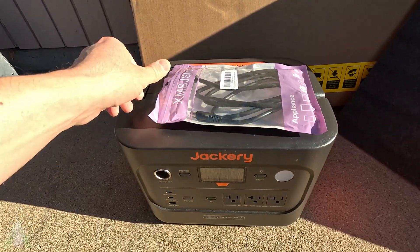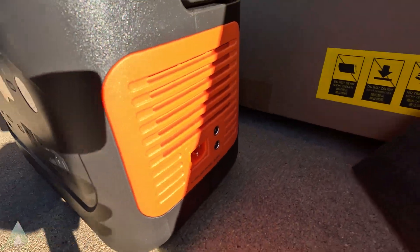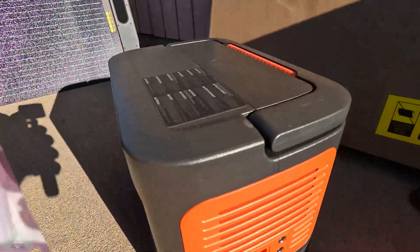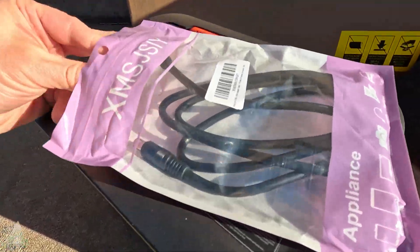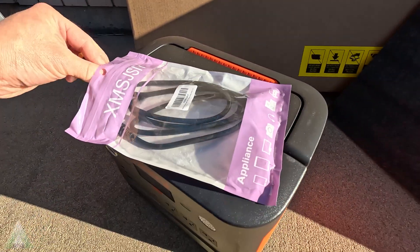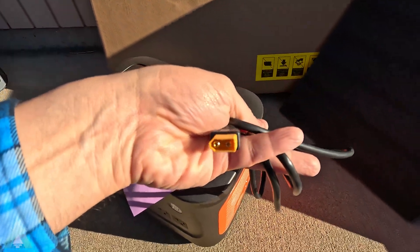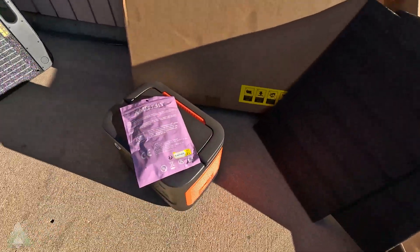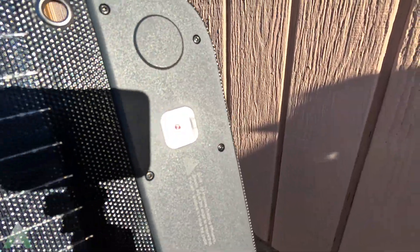In my case, I'll have to use an adapter in order to use it with the Jackery 1000 V2 solar generator. Jackery uses 8mm connectors for the solar panel input, so I'm going to get an XT60 male to 8mm adapter on the Jackery side, and then use the existing cable provided with the Ugreen panel and connect it that way.